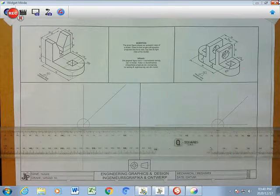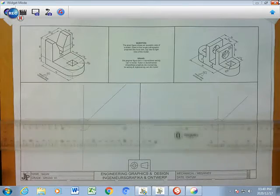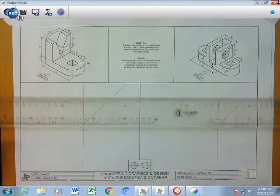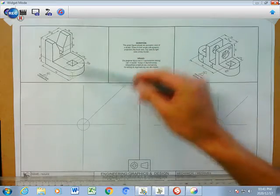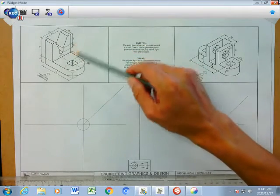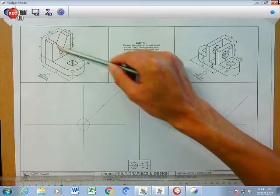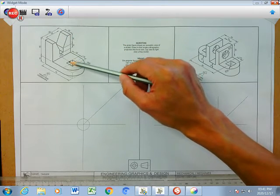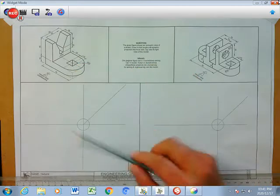So here are two machine drawings which we are going to do, which forms part of mechanical drawings. I've taped my page onto my board. I have my T-square running along the side of my board firmly. What I do have here on the top left hand corner is a machine component, and it has been shaped according to that there, and it has a square hole that runs right through, and that tells me that it's 16 by 16.